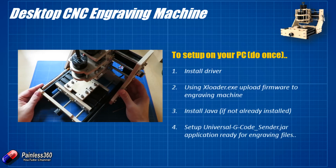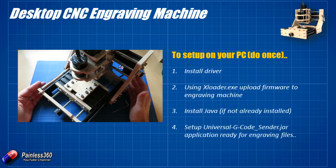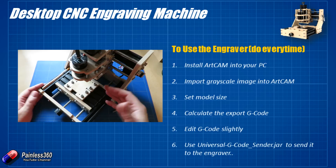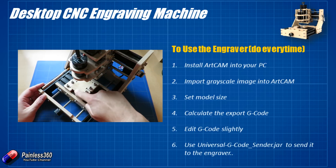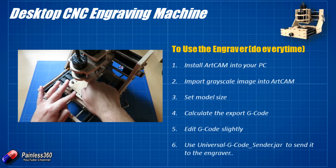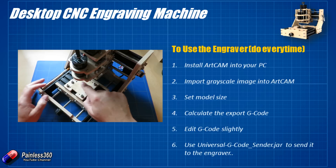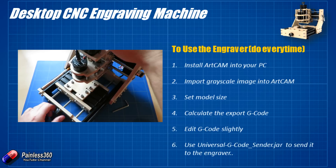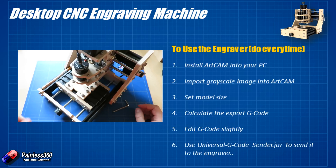Now the challenge that we've had with this is where I'd like to ask for a little bit of help. What's supposed to happen is you install something called ArtCam onto your PC, then install a greyscale image, tell ArtCam the size of the piece of material that you're interested in, and then you also tell it how deep the cut is that you want. Position this piece over the exact centre of the material, then hit go and start sending the gcode.